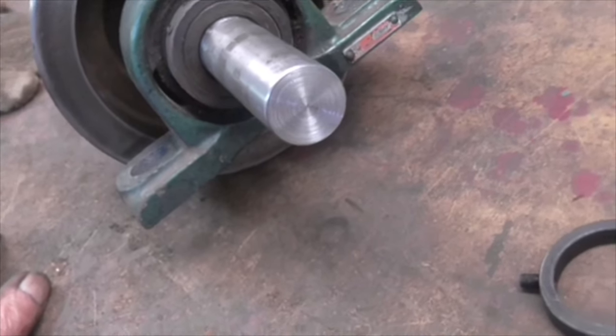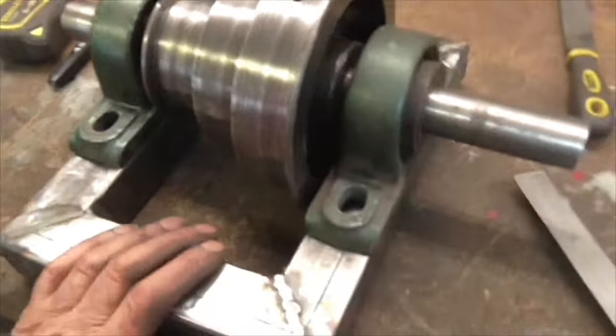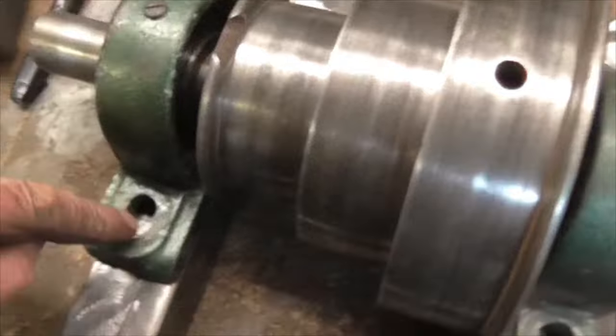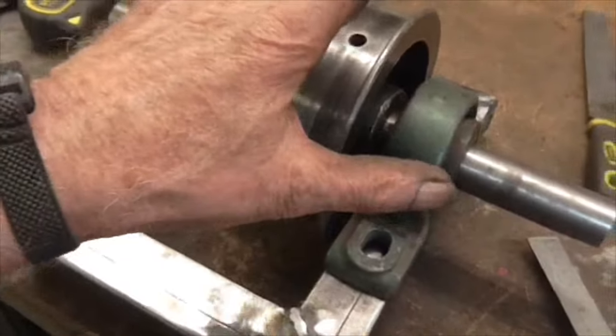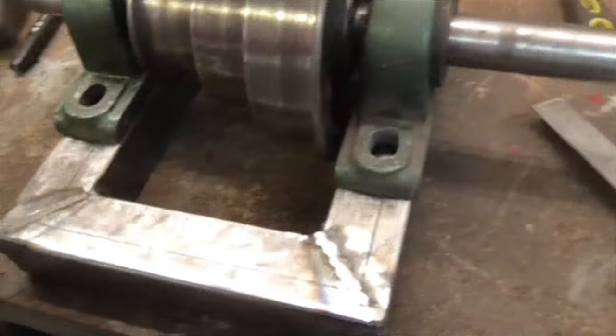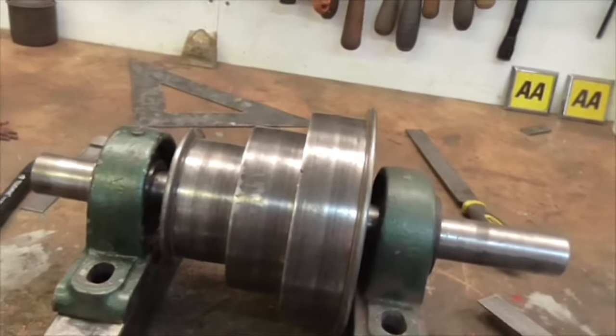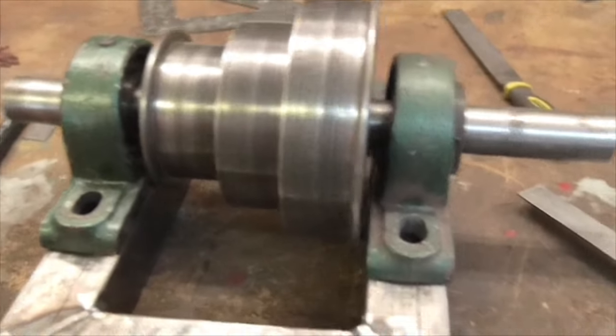There we are, folks, a shaft that doesn't look like its ends have been chewed out by a troll. And the now cooled down box section. So, I'll just show you what my next thoughts are, then I'll bring you back. Right, this is our swinging frame. Bolt, bolt, bolt, bolt. There is some adjustment on these bolts to enable us to get it square. Obviously I'll measure it square first, but we may also need slight adjustment to make the belts run perfectly true. The pulleys seem very good, very true, and I think they are genuine Holbrook ones, so there you go.